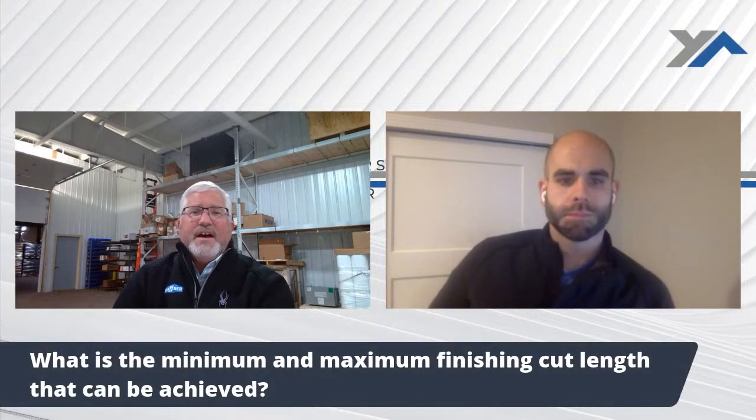Yeah, so you can pretty much gauge based on the back gauge. Let's say you had a 15-foot system. You're going to say typically 5 feet deep by about 20 feet in length. You have to have a little bit of room to move around the machine, but that's a fair guesstimate for the footprint. Let's say you had a 20-foot or 6-meter system. That's the T425 double head. Even though we say 20 foot, that's the actual cut length that you can do on the machine. You still need 5 feet depth, and you need 24 to 25 feet in length.